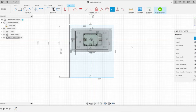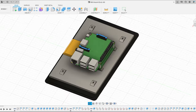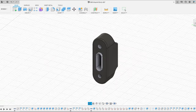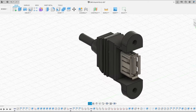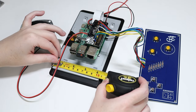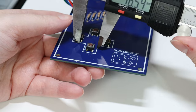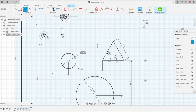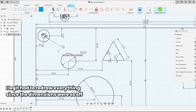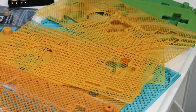At the moment, I design in Fusion 360 for most of my 3D prints. To start off, I downloaded CAD models of the electronics components I use, where I could, to build around. I highly recommend it — it makes life much easier. Mind you, it's still a good idea to measure your physical parts. You'd be amazed at the differences in size of the actual piece compared to their official dimensions. Not even the file I brought in for the dimensions and layout of my PCB, exported straight from KiCad, was totally accurate. Double check your work, kids.